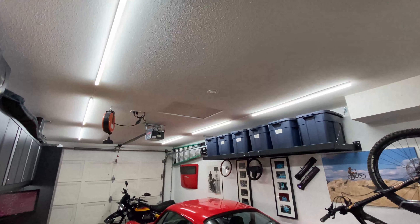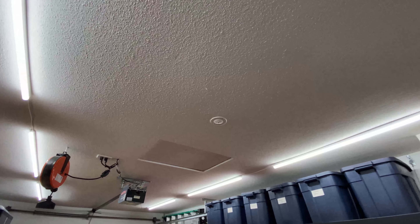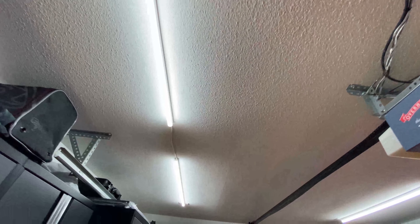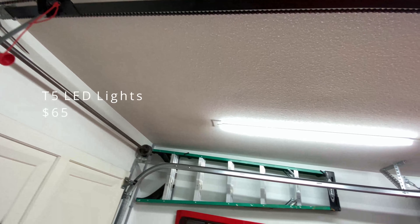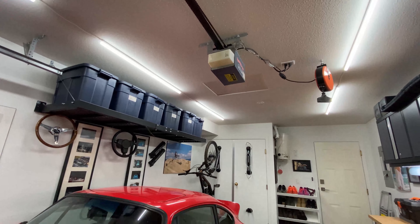First thing I started with was upgrading the lighting. The original was just a single bulb — a lot of old-style places are like that, it's way too dark. I've got these LED T5 fixtures, they're 6500 Kelvin. They came in a six-pack and you can daisy chain them. I wired in a couple new boxes here at the end just for a cleaner look. I think they cost me about $65. Good lighting and a nice white wall color makes a big difference in a small space.